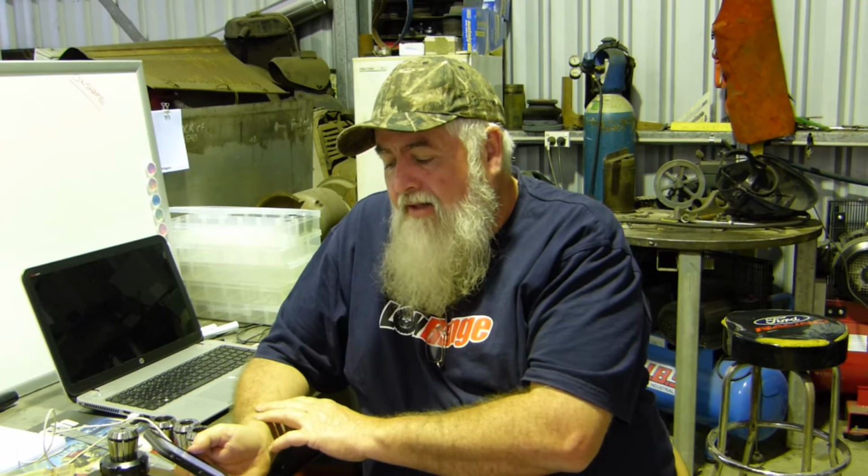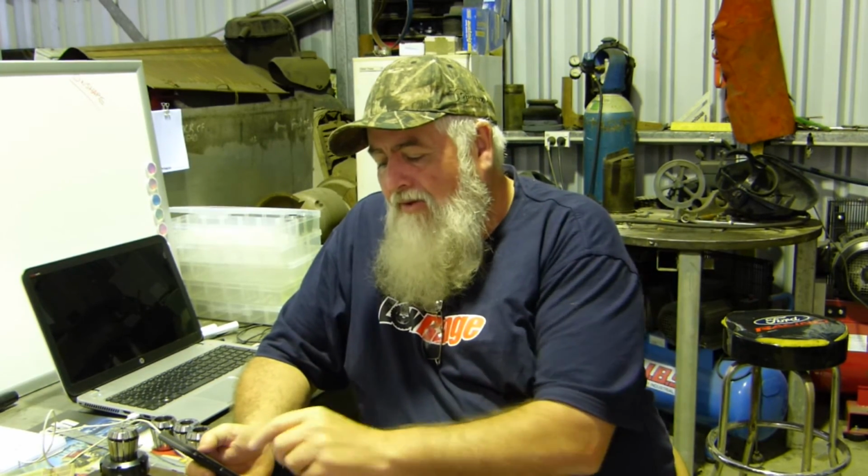I think Ray's Garage had a lathe hollow bore support with a dial gauge on the end, so up the back of your lathe, at the opposite end from the chuck, he's got a little attachment made there with 4 screws for supporting a piece of long bar that comes through, which takes a bit of whip out of it, and that's a good idea. I had trouble with that in the past. I've got some tailstock die holders, a Chinese thing I bought. The Morse taper and shaft are good, but the die holder's little handle, and the way you adapt them up, is shit. So I might look at that.